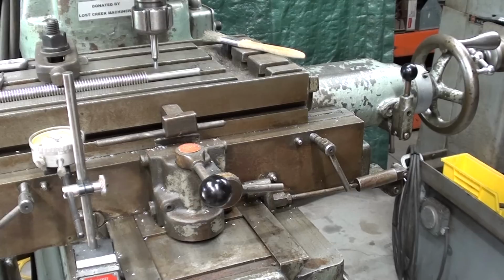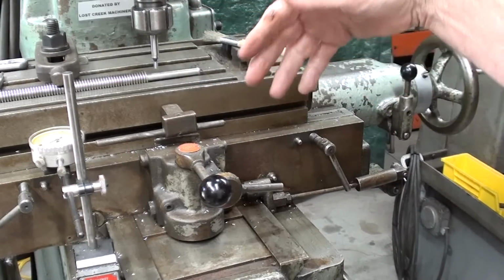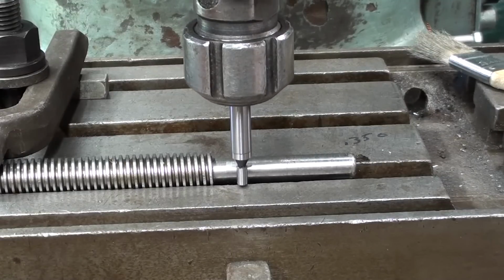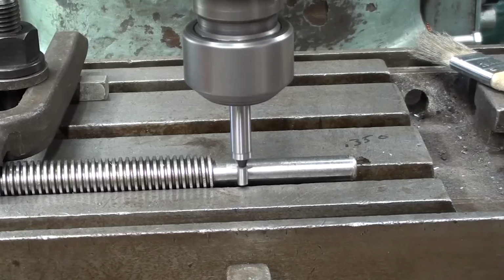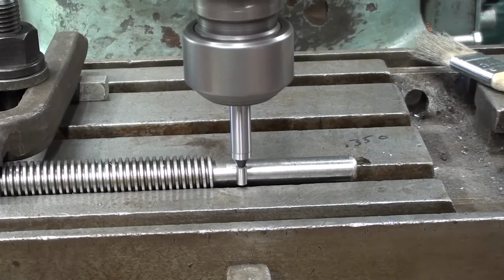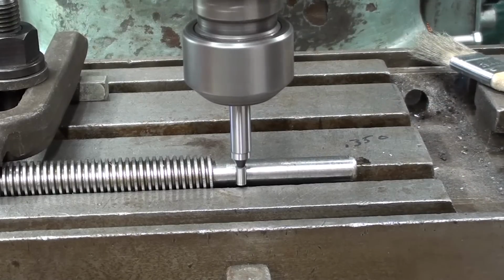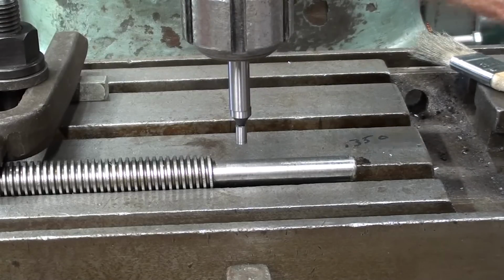But I have to unlock the table, move the table away and then lower the spindle. And I'm edge finding here, you've seen this hundreds of times. Okay, down I go, not quite touching the table, locking the quill, turning the machine on. Did you see the edge finder slip over to the side? I know you did. Now the machine turned off, the quill raised up out of the way,